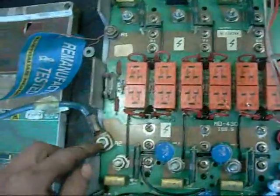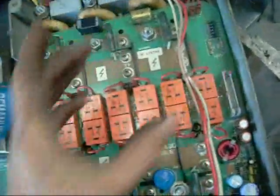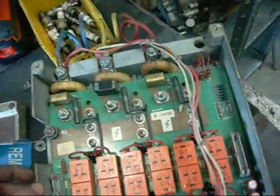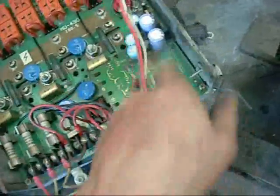Now would this be putting out DC only? I'm not really sure — there's no third phase anywhere else in the drive. There's an earth and that's about it. There are no big capacitors like a normal VFD has, but there is a bridge rectifier here. So I don't know whether it's going AC to DC and then running a big DC electric motor, or whether it's AC only and the DC is just for control.